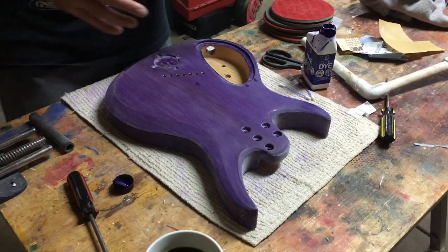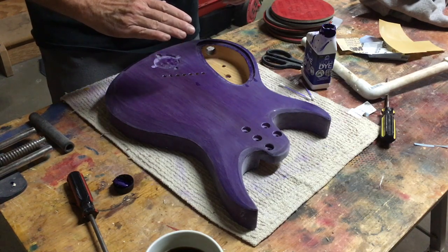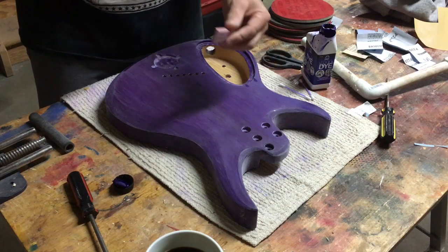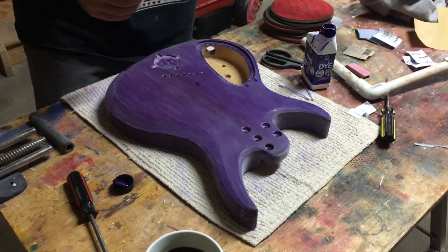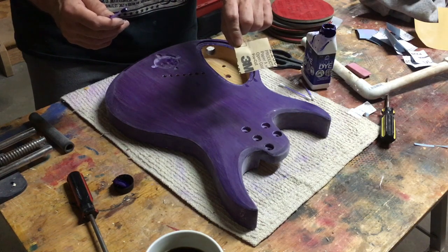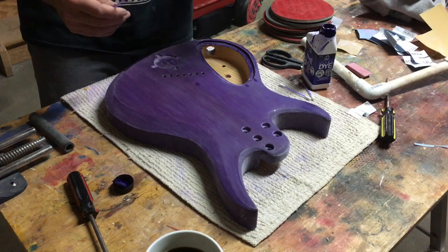Over the last couple of days I've applied a total of about 10 coats of the Crystallac Super Premium Clear Gloss over the top of this guitar. Then I went back after it had dried overnight and lightly sanded the entire surface level with some 220 grit sandpaper — I like to wrap pieces around a rubber eraser. Because it hasn't fully cured, it will kind of clog the sandpaper, so I had to use a lot of pieces. After the 220, I went back over with 3M Free Cut Gold 216U 400 grit to lightly sand the surface and take out the 220 grit scratches.